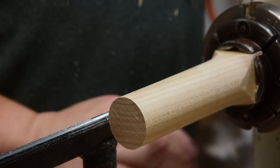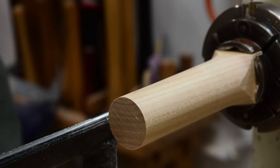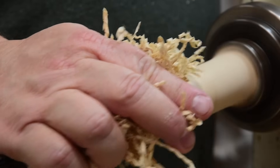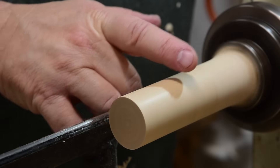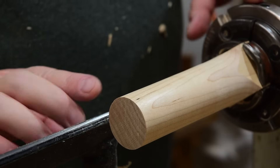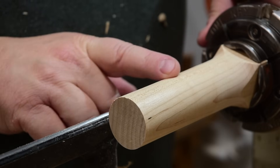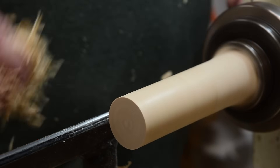I'm going to do half of that, and basically if you've ever watched woodturners, a lot of times they will just reach down, grab some shavings, turn their lathe on to a fairly high speed and just kind of press down. Just a little bit creates a little heat. Can you see the light reflecting differently from about right there? It's really shiny right there and then it dulls a little more here, then gets really dull back here because that's the rough part — that's just the skew — and this is burnished.